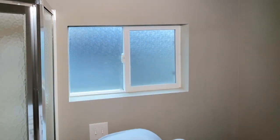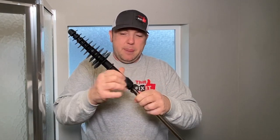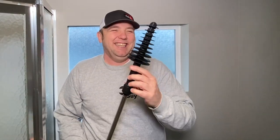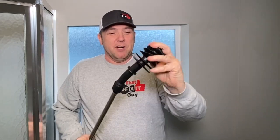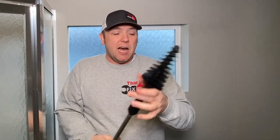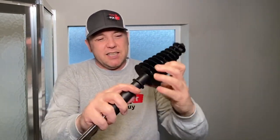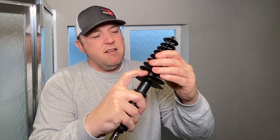I'll take this and screw this together. Right away, this is the funkiest plunger ever. This does not look like your average plunger. It's weird, it's flexible, it's going to bend, it's going to be able to go in the trap. Because a typical plunger — like a force cup type plunger that you use to plunge toilets — it uses hydrostatic pressure. It's just that water built up inside that bowl, and then you're pushing it out to clear the stoppage. This is not really going to do that. Look at that — there are ridges in here. I don't know how that's going to create a seal, so this is going to be interesting.